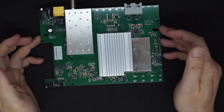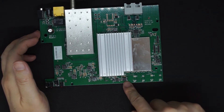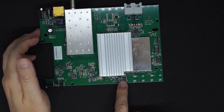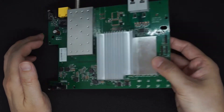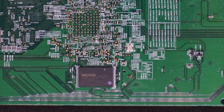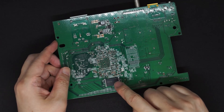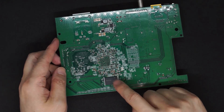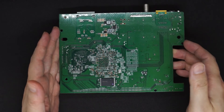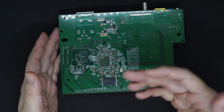This is a new modem, and the flash chip on this modem typically comes as two chips. One is the SPI chip, which is smaller — about 4 meg flash — and it's like a bootloader. There's additional flash on the back which is the NAND flash, and it's becoming more and more popular nowadays. We are able to program the SPI chip on the board, but there is very little tooling that can do the programming of the NAND flash on the board. If you desolder the chip you can use a NAND programmer to read and write it, but it's more convenient to program the chip on the board as we did for the SPI chip.